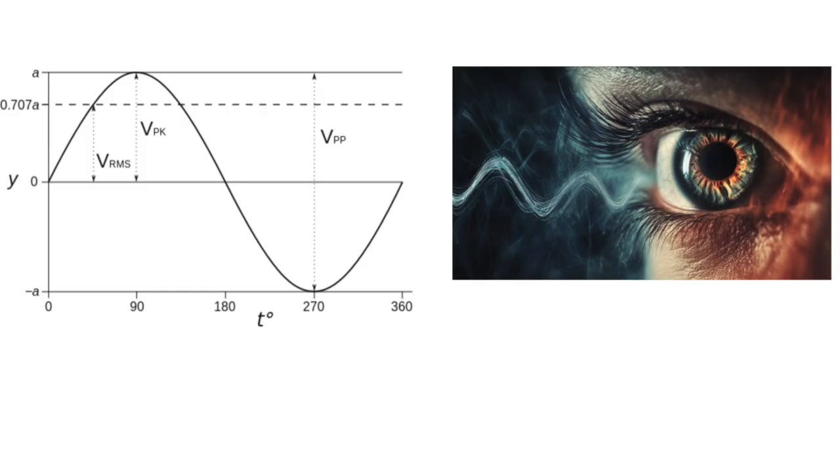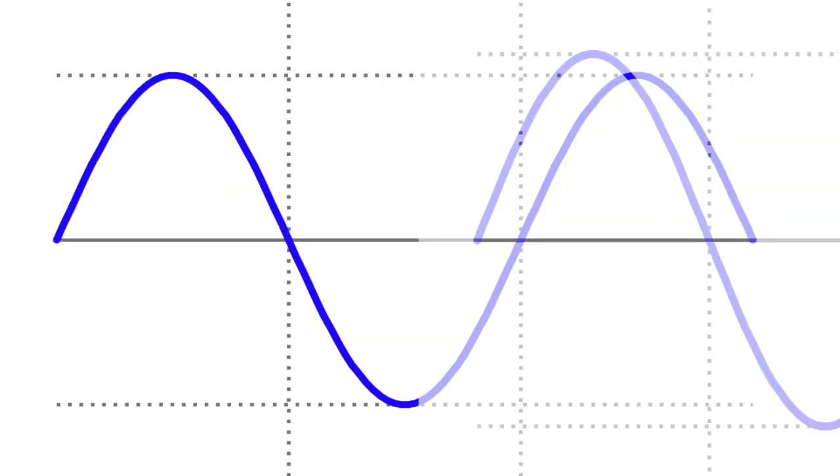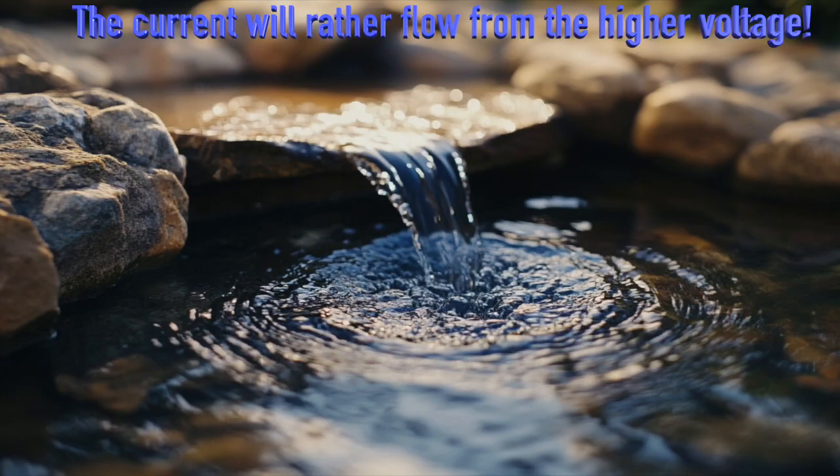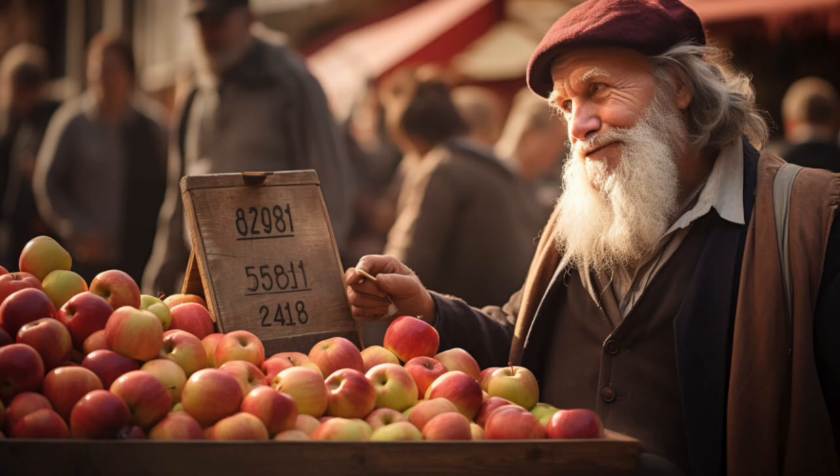That works in the following way. The grid waveform and amplitude is monitored continuously every fraction of a second. The inverter will supply its voltage a little bit higher than that of the grid, and that is true for every millisecond. Then it is trivial to understand that your solar power will automatically go into the grid and into your appliances, taking the place of the grid power. And as soon as the maximum capacity of your solar system is reached, its voltage will collapse a little bit so that the normal grid supply continues for the excess demand. It's like a small vendor of apples that are a little bit sweeter than those of the supermarket — you take him of course. And as soon as the vendor finishes his capacity, then you go back to the supermarket.